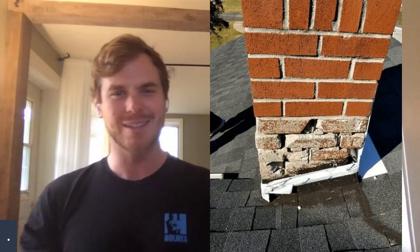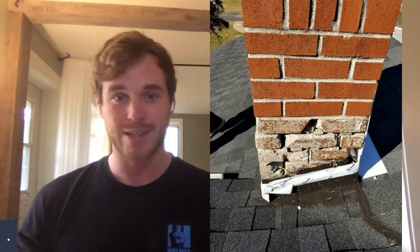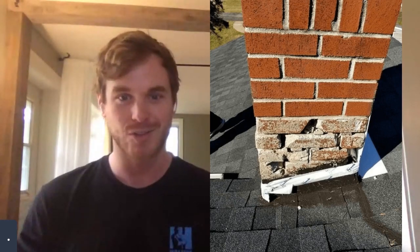That looks like a chimney that has been poorly flashed. There's no actual flashing — just Tyvek tape around old crumbling brick that needs to be replaced with new brick on top. This needs to be taken down and started from scratch. You can't build new on top of an old crumbling structure. That chimney has to be completely redone; it's not stopping anything from getting in and is just a hazard.